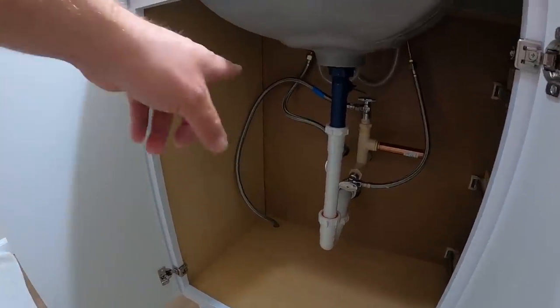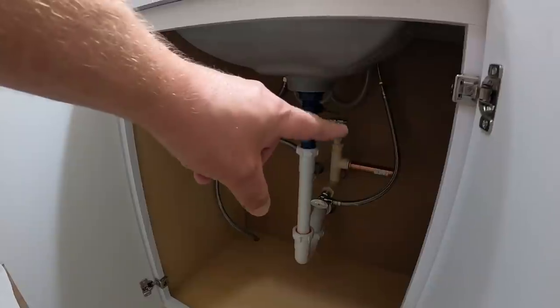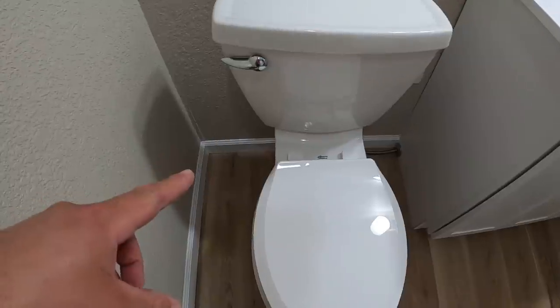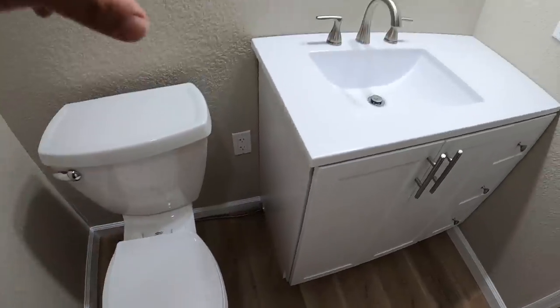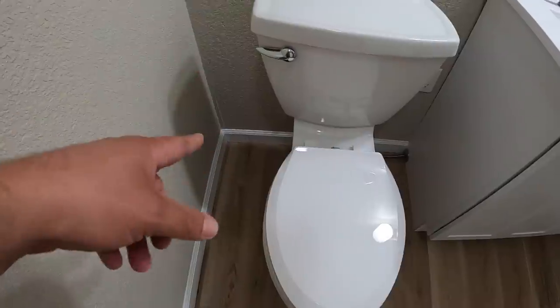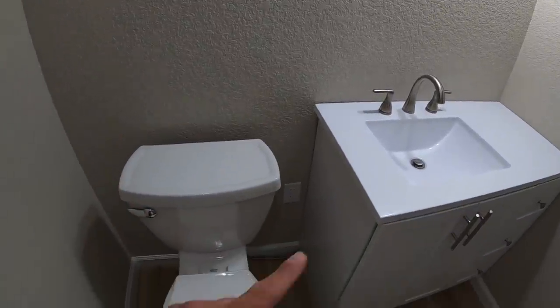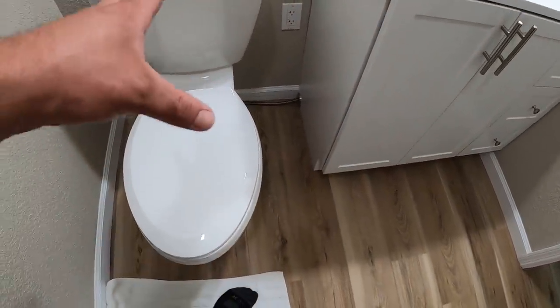In the powder room, it's straightforward — drain hoses screwed to the back wall, my hammer arrester mounted in there. I looked it up: you can mount hammer arresters in any direction. I have two separate cutoff valves — one for the toilet, one for the cold water on the sink — and hot water for the sink itself. I came out the side of the cabinet with a little decorative piece, and my stainless hose runs right to the toilet. We're going to put a trash can right here, so you won't even be able to see the hose. That was the best I could do with too much going on in this two-by-four wall to run plumbing over.